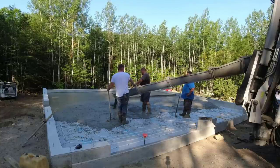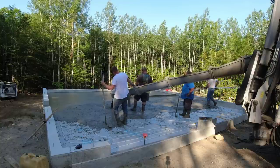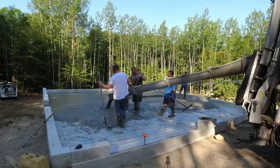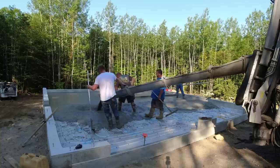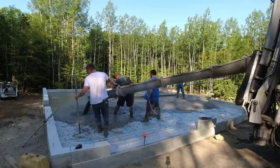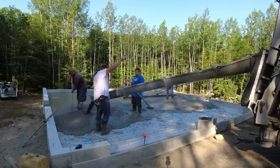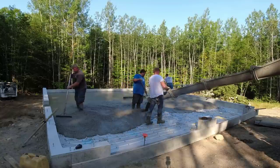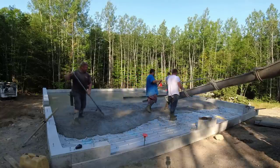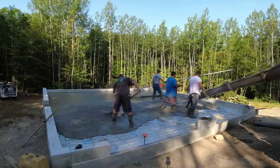And then about November 15th, most of the concrete companies that have the ability to heat the water will start putting warm water in the concrete. Some will do it a little bit before, depending on if the temperatures get below freezing at night before November 15th. They'll crank on the boiler and you might get 70, 80, 90 degree water in the mixing drum of the truck. And then from November 15th usually to April 15th they start charging for warm water, so $5, $6, $7 a yard extra. And then they'll crank the temperatures up depending on how cold it is.